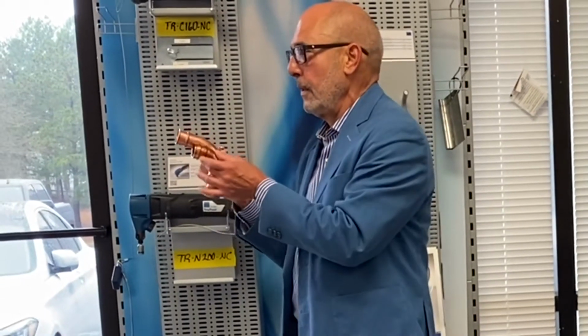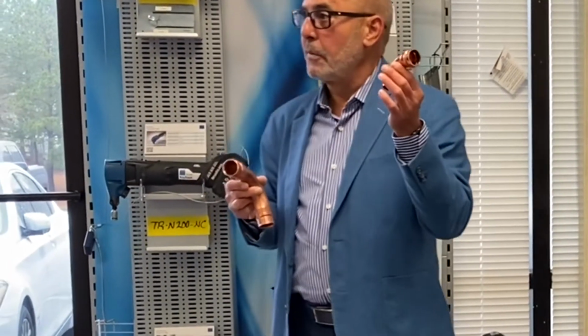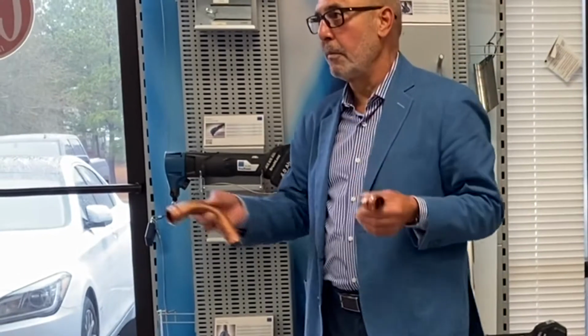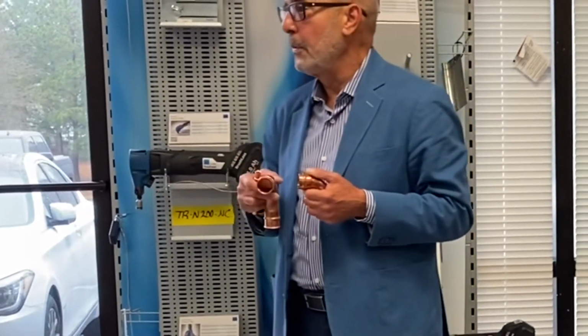And there's to this, when you're using short radius, you have to start adding copper piping to the system to compensate for the loss of velocity. So, especially when you go to VRF systems, you're losing a lot of the efficiency. Versus this, not only that, you have to add up a substantial amount of copper tubing to the system to kind of compensate for it.